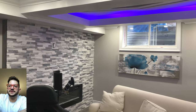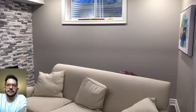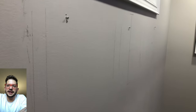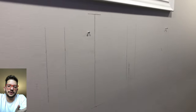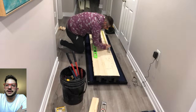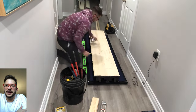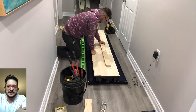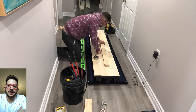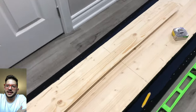Here is the rear wall of this basement studio we're treating — there's the painting we're removing and the diffuser will go in its place. These clients wanted the diffuser centered to the window casing rather than the rear wall, but with the French cleat we have adjustability to slide it left or right. I'm marking out the studs and the height where we want the diffuser to sit, then marking where the top of the diffuser-side French cleat will sit, lining it up with the center mark.